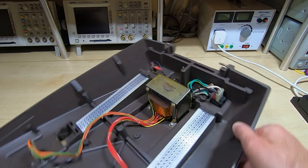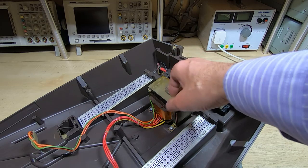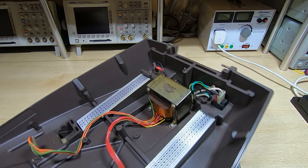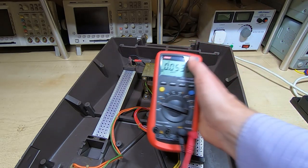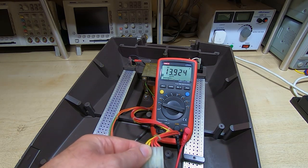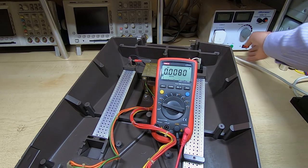All the wiring is back in place — I've got the main switch fitted, all the grounds connected, and the fuse holder fitted. I've replaced the fuse with a 0.4 amp fuse, which is what we require for the UK version now that this has been rewound. Before we fit the main board we'll just do a final sanity check to make sure that everything is still behaving the way we expect. I'll connect the test meter to one of our 12 volt outputs of the transformer and power this up — we should get something between 13 and 14 volts.